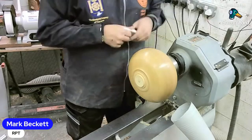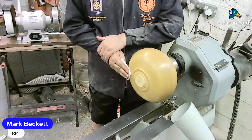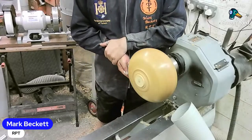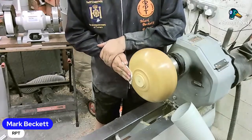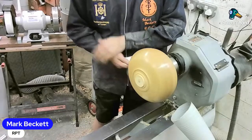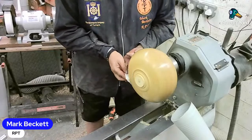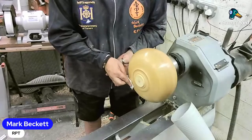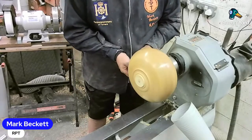Is the high gloss not a microcrystalline wax anywhere, though, Wayne? It's got some microcrystalline in it, but it's a cocktail of the two. It's not a pure microcrystalline. A better representation would be Chestnut Products Wood Wax 22. If you use that as a base coat and then use the microcrystalline wax as a top coat, you will get an absolutely brilliant finish with it.